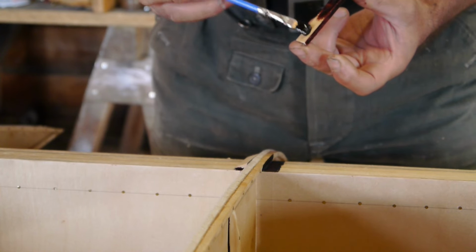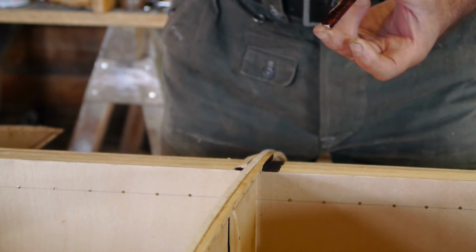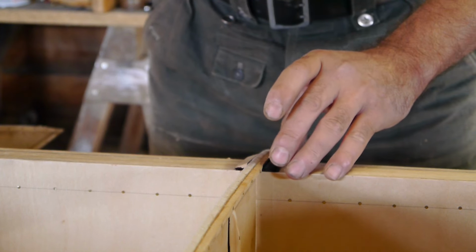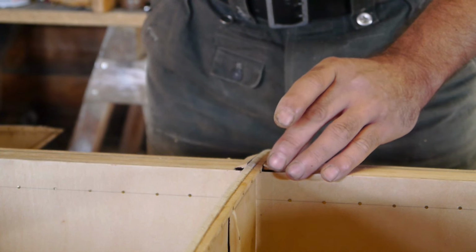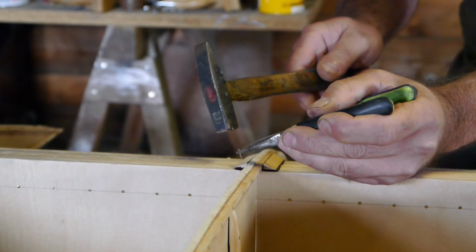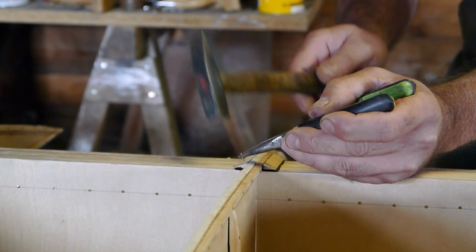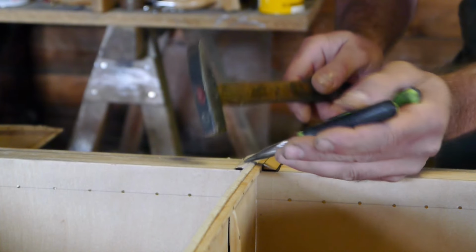So, first everything is smeared with the Aerodux, then the parts are nailed on. After nailing, you can also wipe off the Aerodux that has oozed out. You can then press it on again with a center punch, wipe it off again, and it actually looks relatively nice.